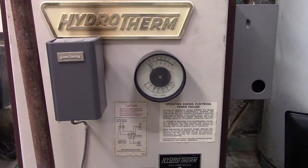There is a fill valve on the boiler, and it might work and it might not. There is water pressure going to it. Allegedly, it will take some if it needs some. But I was always filling the boiler manually to ensure it had proper pressure. That was bad to do. I later found out because the pressure I had it at was way too high for what it needed.